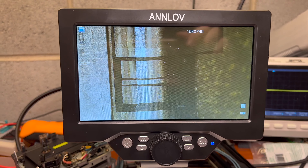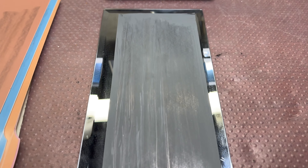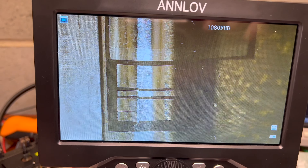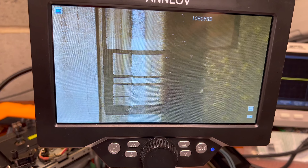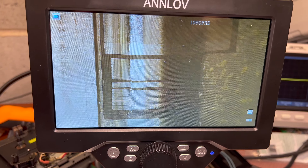Here you may see how the head looks after we go with the raw grit — the biggest grit for now. Here is the playback head — you may see it has become straight and nice over all widths of the head. The record head also looks nice and straight. The only thing is I can see it cannot get fully beyond the gap — it just touches the gap and goes a little bit further. I would prefer to go more, but that would require removing much more material, which I'd rather not do right away. It should still work fine.